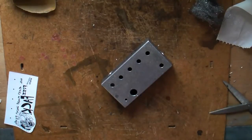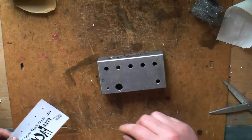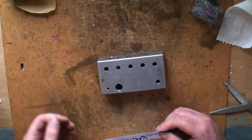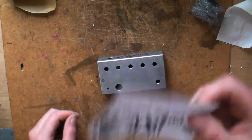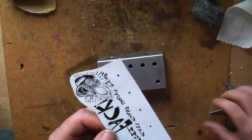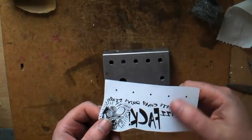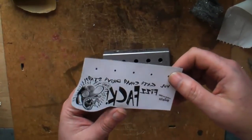Now your toner medium. What you don't want to use is normal paper — that just won't work, or it might but it'll be a right old fanny on trying to get it to come off. You want something a bit glossy like gloss inkjet paper, but that's a bit fiddly, it doesn't come off very well. Some people swear by magazine paper. I happen to have stumbled upon the very best thing in the world, which is the glossy backing to the address labels that I print all your lovely parcels with. It is absolutely perfect — it's cut to A6 size which is the right size for all the boxes. The toner just sits nicely on top, firmly on there, but it's not engrained into the paper.